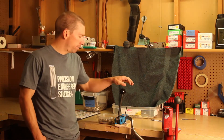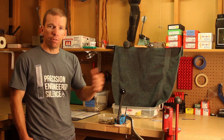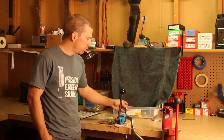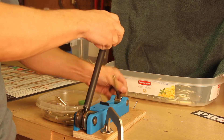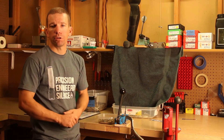What I could buy is a Dillon Super Swage 600, which is essentially the swaging process on the 1050 taken off and put into an individual tool. The way that it works is you just drop your brass down over this little post, handle down, handle up, post up, take your brass off and it's swaged, then you go to your next step in your process.